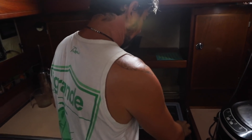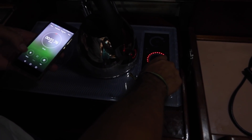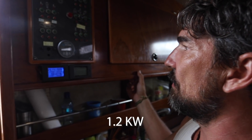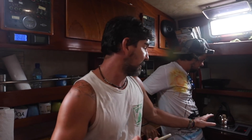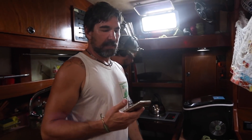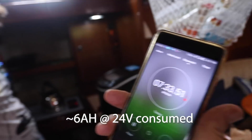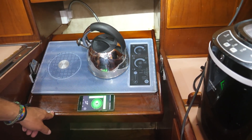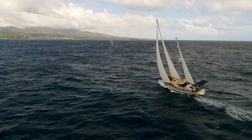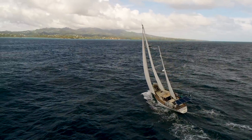Power on and start. How much power are we using? About 47 amps altogether. And it's giving off basically no heat compared to the gas — which is key on a boat. And we're not using any propane. Seven minutes and 25 seconds — one minute slower than gas. Boiling water using the harvested power from the sun and wind is a huge step for us in removing our dependency on propane, even if I have to wait a bit longer for my tea. And the fact that we're not heating up the galley with waste heat anymore is a major bonus. We're going to use and abuse the system for a few months and report back with our results.